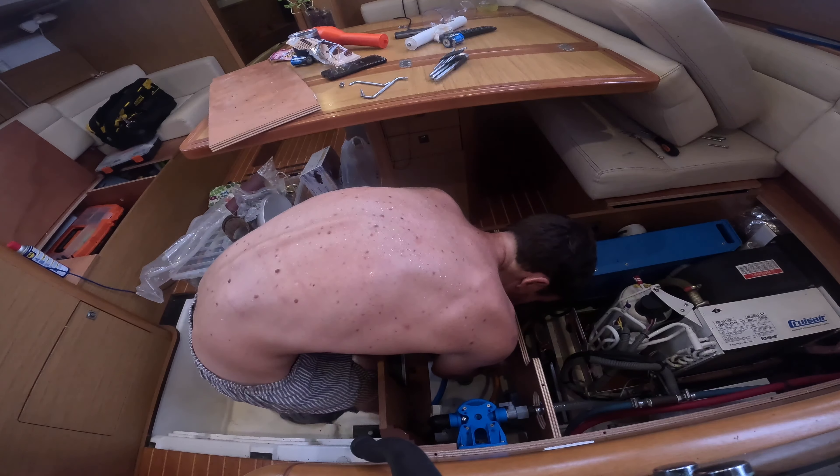It turns out that when we plug our boat into shore power, we are a 220-volt boat. Most of the power here is 110 volts — they did give us a converter, but they did not convert the hertz. After running our AC on the wrong hertz, it has ruined our motor, not our pump like we initially thought. Unfortunately, we ordered a new pump, not a new motor. So now we're going to have to run without air conditioning, which in the long run is fine because we can't use it out of the marina anyway.